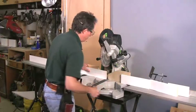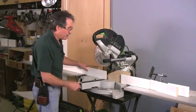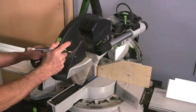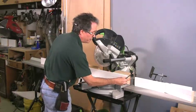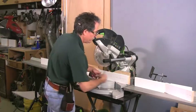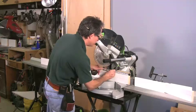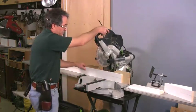We have one more piece to cut. First we cut the mating miter to come out of that inside corner — because the inside corner is the last one we had — and we want to pull from there 8 inches to the back of this molding. And this is a butt cut.